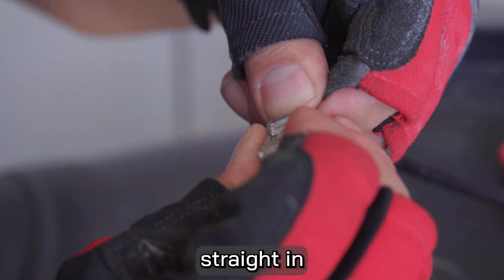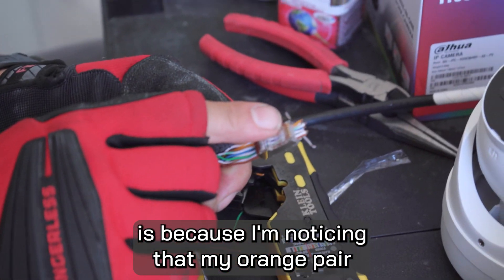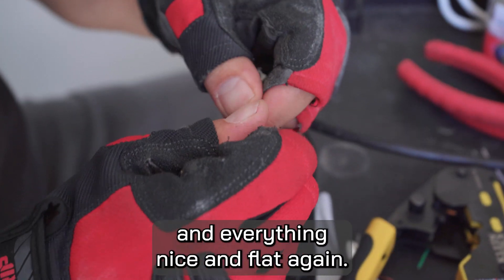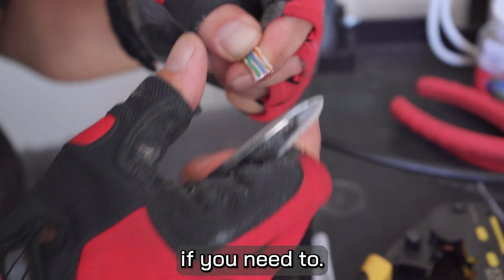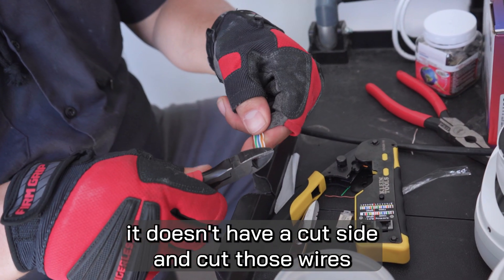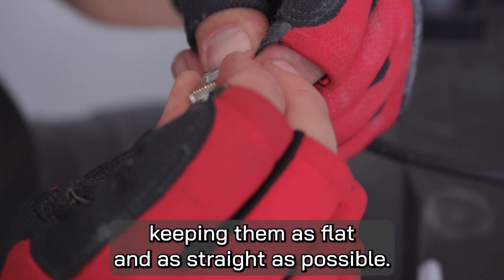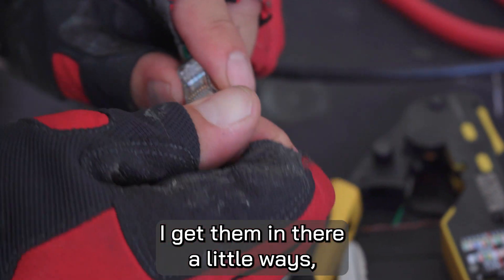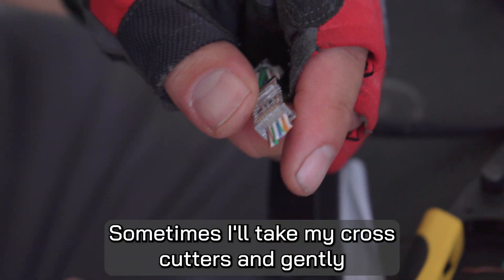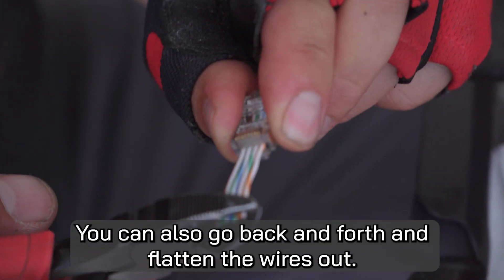The most difficult part with this wiring is fitting all these into the little RJ45 connection. The goal is to keep them as flat as you can and slide them straight into the block. These ones I'm using are pass-through. I'm noticing my orange pair has flipped on me as I slid them into their slot. Get everything nice and flat again — you can use your lineman scissors if needed, or your cross cutters. Slide them in keeping them as flat and straight as possible, then verify your color schematic is correct for a type B connection.